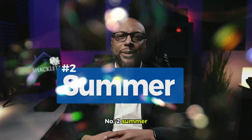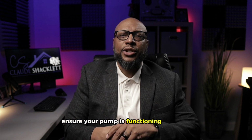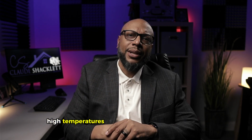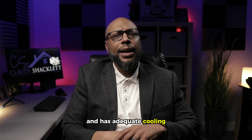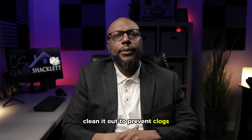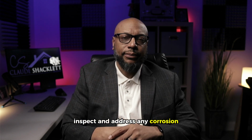Number 2, summer. Summer storms can be heavy. Ensure your pump is functioning correctly with routine tests. High temperatures can cause the pump to overheat. Make sure it's not running continuously and has adequate cooling. Summer can bring mud and debris into the sump pit. Clean it out to prevent clogs. Humidity and moisture in summer can lead to rust. Inspect and address any corrosion.